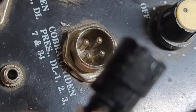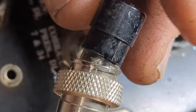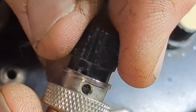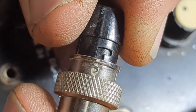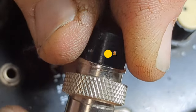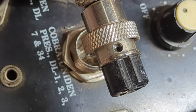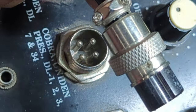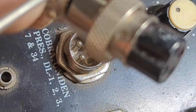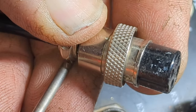Let's put the protector back on — slide it right over to protect the solder connections so it doesn't short out against the housing. Now if you look, there's a little dot on the connector — line it up like playing Pac-Man, turn it to that dot, there you go. Now remember that tiny screw you weren't supposed to lose? Put it back in — don't overtighten it, it's only plastic.